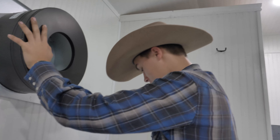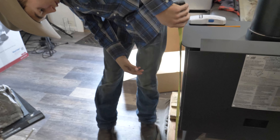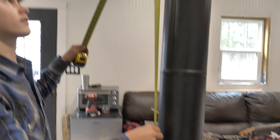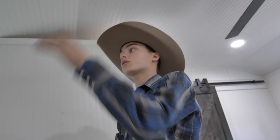The stove will be a little off-centered, but I think I might be able to fix that when I cut out this trim and move this part flush to the wall. The part we need to check now is the height. Let's measure from the feet to the top — 29 inches. Then all we have to do is add our pipe lengths: 24, 24, so that's slid in there. All I wanted to get from measuring was to see how high we can put this up, because the higher we get this, the higher our pipe can go.